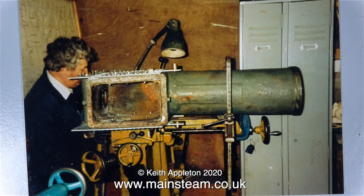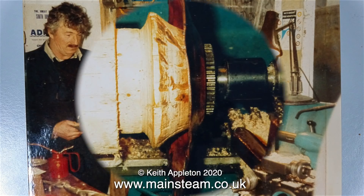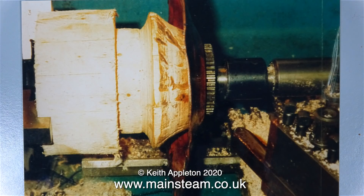In this photograph, as you can see, the side plates have been fitted. And now for something completely different. This photograph shows the setup in the lathe for forming or spinning the copper top for the chimney. This is a wooden former in the chuck, and by using a lot of lubrication and a special round-nosed non-cutting tool, the copper is persuaded to take on the same shape as the wooden former. And that's easier said than done.